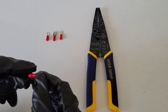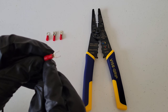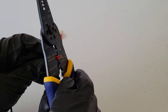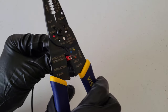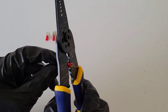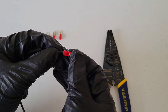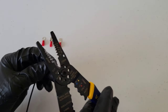Put the wire into the electrical connector and crimp it. You want to crimp in between where the flared part of the connector ends and the end of the red part — right in that zone. Gently hold the handles to keep the connector in place, make sure the wire is positioned correctly, then squeeze down on the handles until it crimps the connector onto the wire. Then perform a pull test to make sure the wire is secured and doesn't pull away.